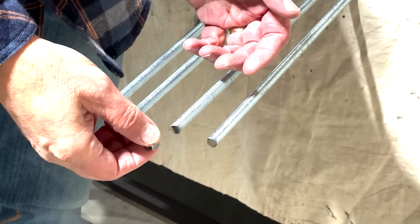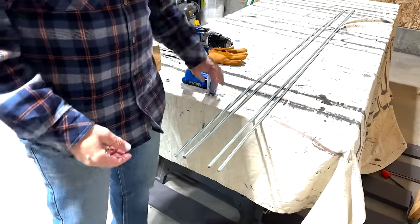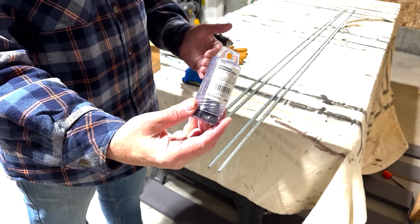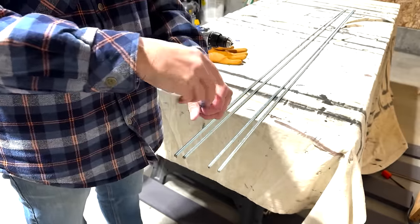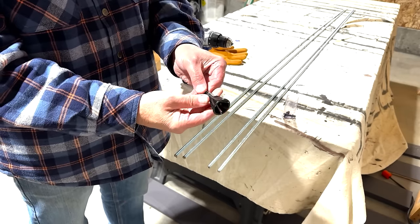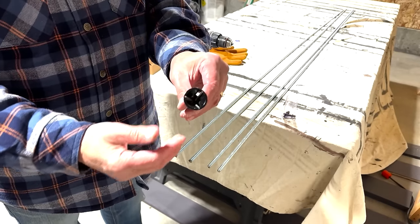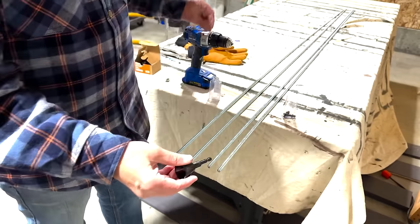However, I've come up with a foolproof solution. It's called an external chamfer tool, and I'll put an Amazon affiliate link below. If you use my link, it costs you the same on Amazon but a small portion of the sale comes to me. It's a chamfer tool that attaches to your drill — it's cone-shaped with carbide steel blades on the inside. It knocks the burrs down and puts a nice chamfer edge on your threaded rod. You can also use it when you've cut off a bolt and want to easily thread a nut on.